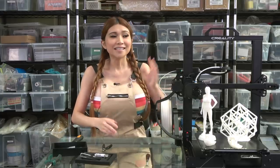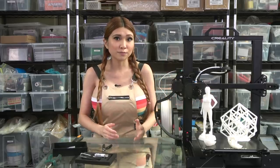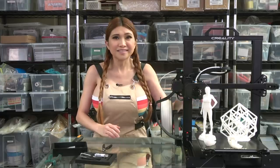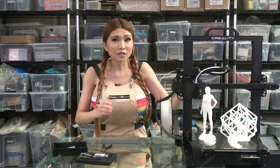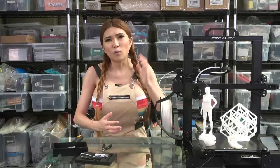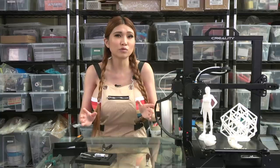A few observations. Obviously, this is almost a finished product. The advantage of crowdfunding is cost — group orders mean lower prices. The only thing I'd like to see done before it ships is a good variety of slicer profiles and test models on the SD card. This printer is different enough that the profiles of other Creality printers just don't give acceptable results. My concern is it will be a while before the nozzle and bed leveling parts are available through AliExpress and other online retailers as replacement parts. I don't really like only being able to get parts from one vendor.